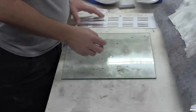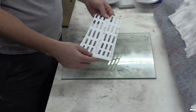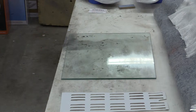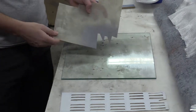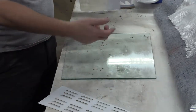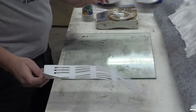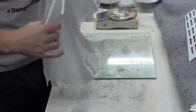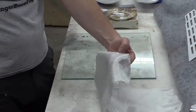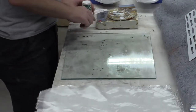So to recap on fiberglass: this is the perforated plate that goes through the midsection on the F-14 — I don't want to use this. I have two weights of fiberglass: a layer of two-ounce glass and a layer of six-ounce. I could probably get away with just a single layer of six and be fine, but figured why not? I also have a gram scale to weigh out the resin appropriately.